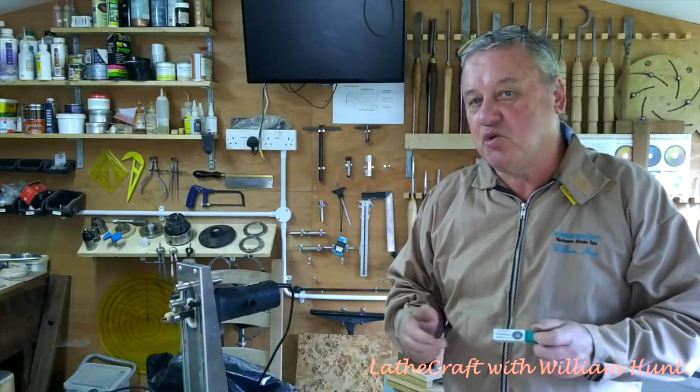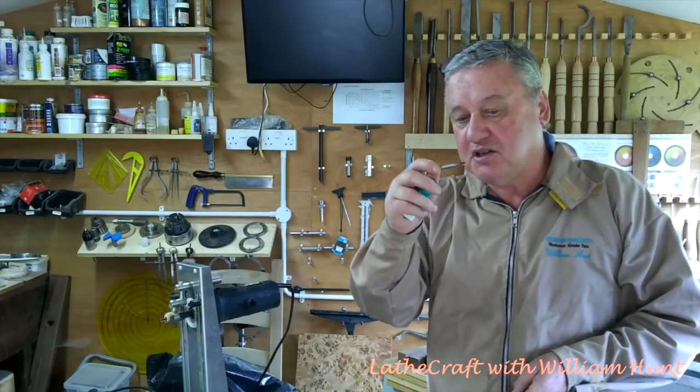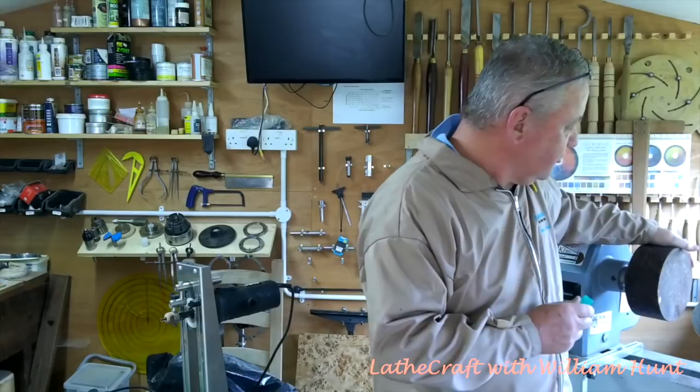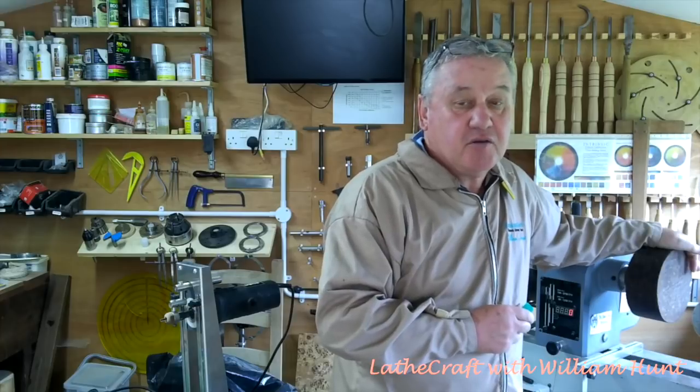Following on from last week's quite successful project, which was a simple burr chestnut bowl with a few iterations with a 6.3mm cutter, this week I'm going to attempt something quite similar, except I'm going to try and make the work a bit finer. I've invested in some new cutters, and this is the one I intend to use today, a 3mm cutter. And the piece of timber I've pre-chosen is this blank, which I believe, and I'm not quite sure, could be Brazilian rosewood.